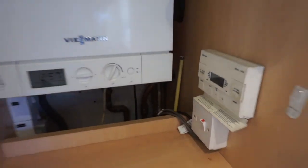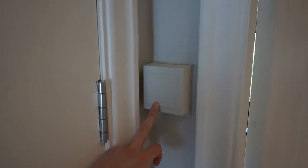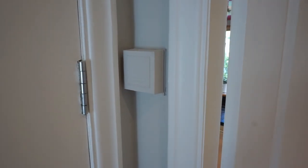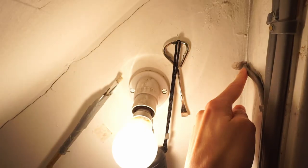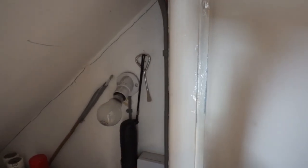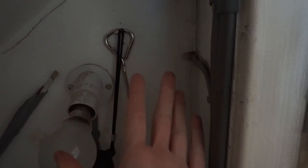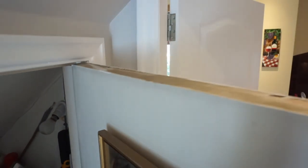For thermostat control they've got this thermostat here, and we don't even know if it actually works — it's always been set to maximum. To date it: the temperature is in Fahrenheit, so that tells you how old it is. It does appear to still be wired in though. In the cupboard next to it there's a twin-and-earth that comes out the wall, so I suspect it connects to the thermostat. We need to find where that's wired in under the floor and disconnect it. The Hive will do all the thermostat control instead, which makes a lot more sense.